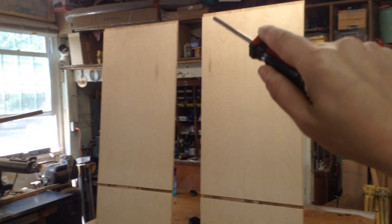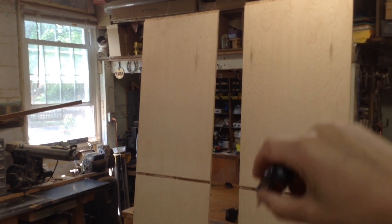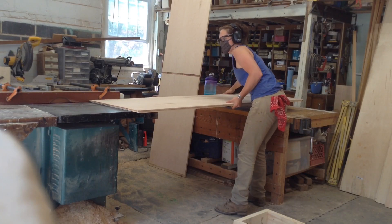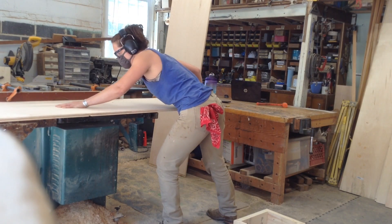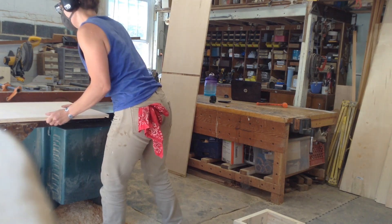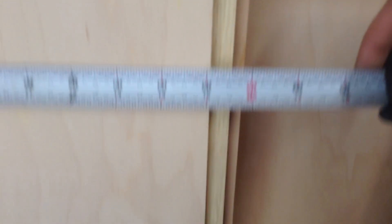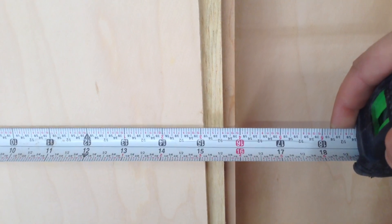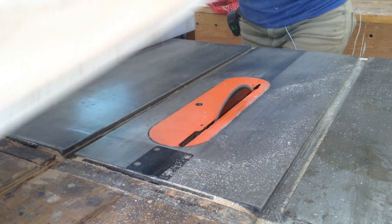Since I'm transporting it and I knew it was going upstairs, bringing that cabinet up with added wood was going to be a real pain — you'll see how I solve that in a later video. Once I have all the marks for my shelves — I'm calling them bottoms and tops, but essentially all cabinets are getting three shelves — I can go through and cut the rabbet for my backer. I use half-inch backers on all of these, which is a little bit of overkill, but these are really wide pieces and I definitely wanted backers on them. I prefer to have them — they square up the piece, make everything sturdier, and make installing easier since they're already square.